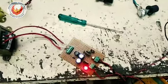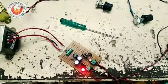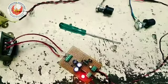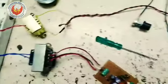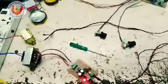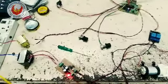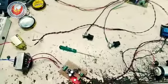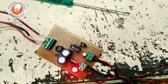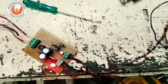The power supply board provides 12 volts for the pump and 24 volts for the solenoid valve. I am using one transformer for powering the microcontroller and sensor board, and another transformer for powering the pump and solenoid. They are separated so the loads are different — one is 1 amp and the other is 500 milliamps.